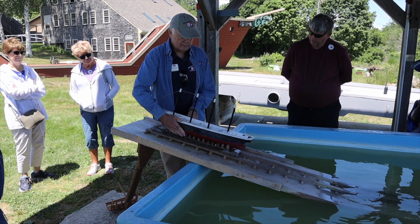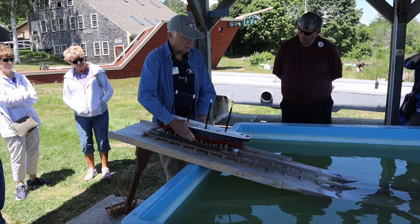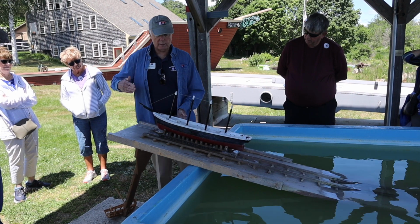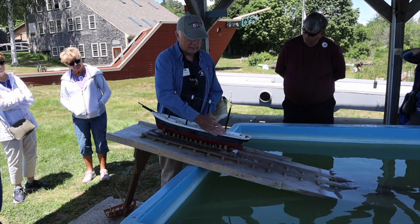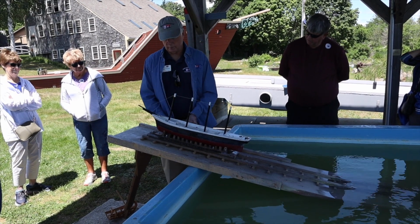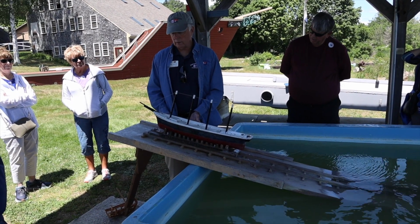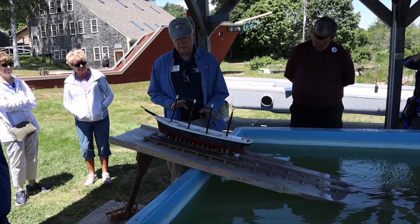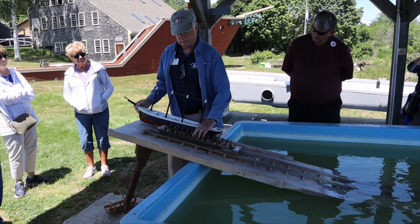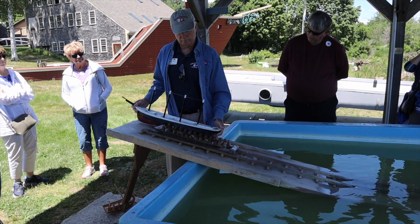And when they've got this in close contact with the hull, the vessel is wedged up. That enables them to knock out some of that temporary bracing that's still remaining along the sides of the vessel, because now the cradle assembly has control of the hull. It doesn't have any weight yet. 99% of the weight is sitting on the keel blocks, 1% on the cradle.